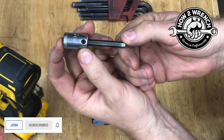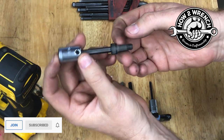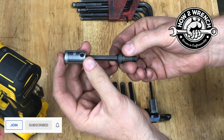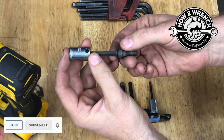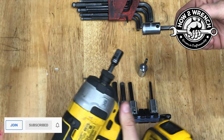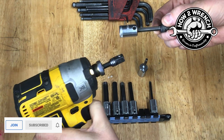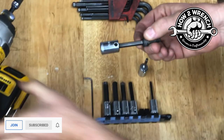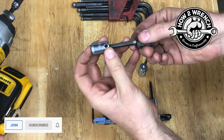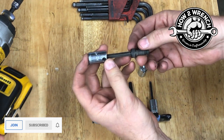But there's one other thing that causes these fasteners to strip — this set screw being loose. If you think you're bottomed out but you're working upside down or in awkward places where you can't see well, and this thing is loose, your natural tendency with the weight of the tool makes it hard to keep everything perfectly tight. As you're working along, the driver could be moving a little bit, and that extra play is what causes it to slip off and strip the fastener.